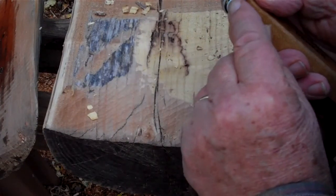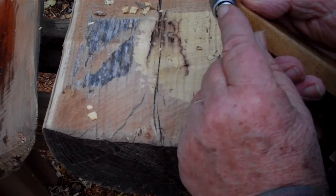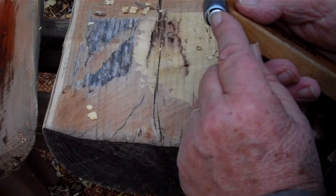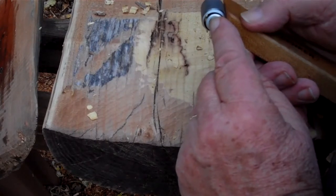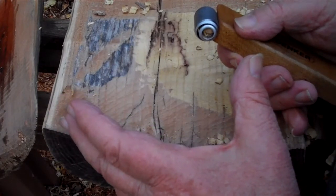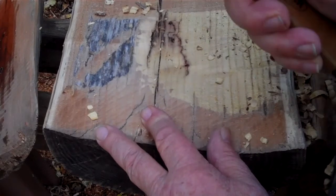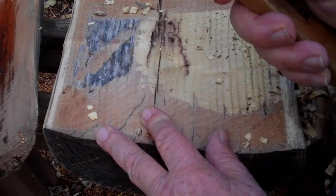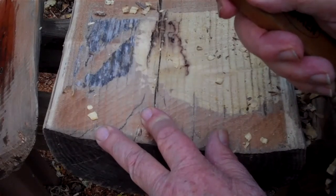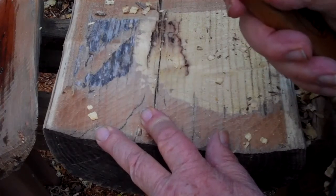This little piece here, inside the cutting sleeve, keeps the tool from taking too much, and therefore it won't stall. If you don't have this piece, it's just an open scorp. And the scorp is difficult to use because you have to steer it all the time. If you allow it to catch, it'll dive, and then you won't be able to pull it. So you have to be very skilled to use a scorp properly. You also have to be strong.